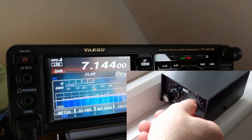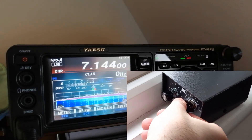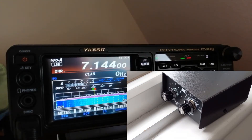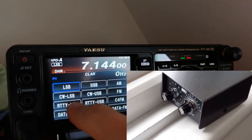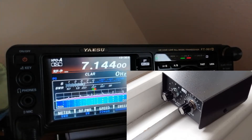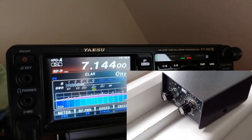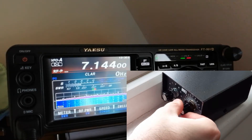You're again looking for the peak of the noise. You have to change the mode or at least lower the power. You can use either FM on low power or CW, which I'm going to use. I've already programmed it to CW, 5 watts. So if I press the PTT it's going to do 5 watts. And again, looking for the peak signal, peak noise.